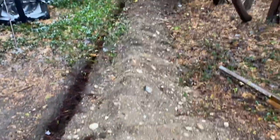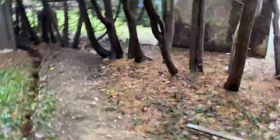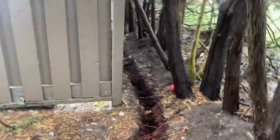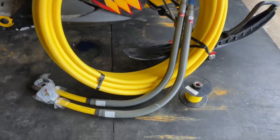The price of getting delivery service with the larger tank was very expensive — you didn't get the Costco rate and you had to pay the delivery fee and the rental fee for the tank. So this is a means to an end. I was advised to dig the trench about 12 to 18 inches, so I went about 15 — split the difference. This was a major hard part right through here between the fence and this cedar hedge. Here's where I've got to come up — my first riser — and here's all the material: I have my one-inch line, about 125 feet, my two risers, and my tracer wire.